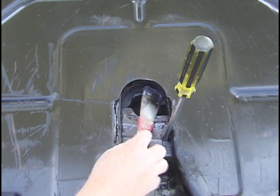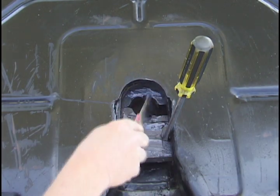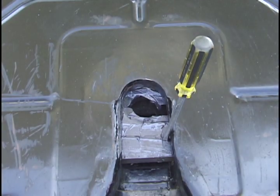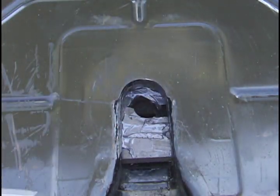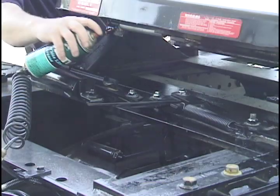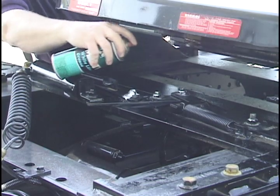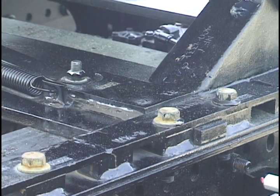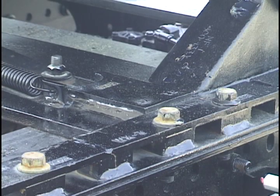Also apply grease to the stationary jaw at the front of the throat. Now, work the lock mechanism back and forth several times to further distribute the grease. For sliding fifth wheels, lightly lubricate the pivot points of the mechanism. Operate the mechanism to ensure it is functioning properly.